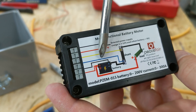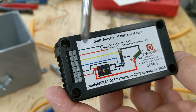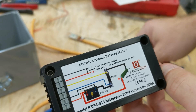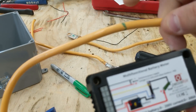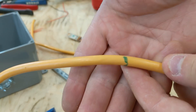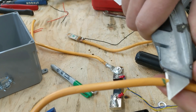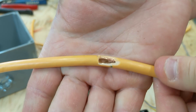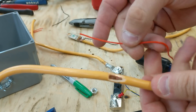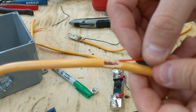I'm not going to run these wires from the meter to the battery — I want to do everything self-contained inside the box. So instead, for my positive I'm going to cut a little bit of insulation off and solder on a wire. Inside the kit the shunt comes with a red wire and I'm going to solder this on here.